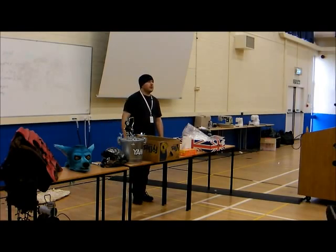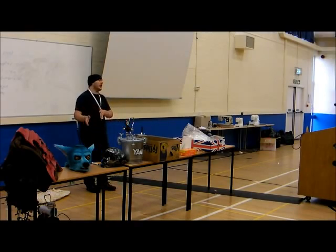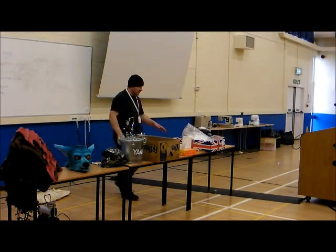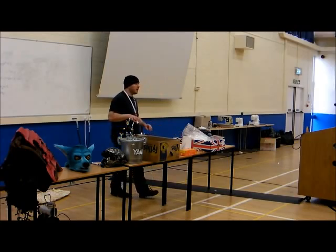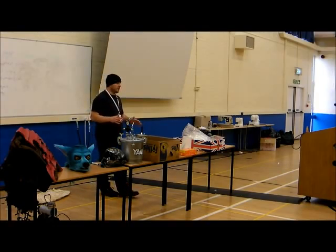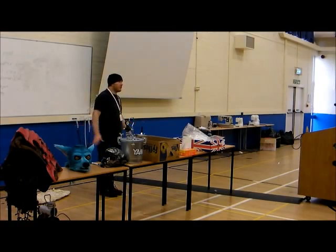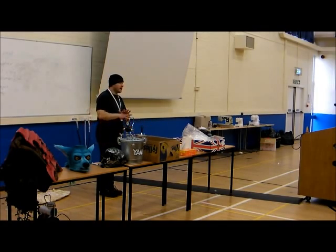Is there anything interesting that happens if you try it at the other end, to try putting it in the vacuum? You will add bubbles. They expand. Yeah, this is another interesting thing that I didn't actually touch on. I haven't actually done it. I don't own one, because you can get around it by doing a thin stream. When you're pouring silicone, if you go back home and look on YouTube, you might hear people talking about vacuum chambers. What a vacuum chamber does is, if you put silicone in a vacuum, it causes it to foam rapidly, but then for some reason it crushes and all the bubbles get eradicated out of it. You can do it in a pressure chamber as well, but it doesn't work quite as well.